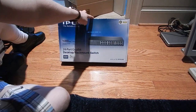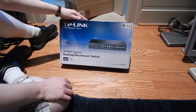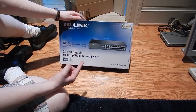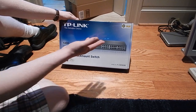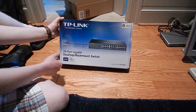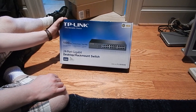A nice 24-port TP-Link switch — this thing is gigabit obviously. The reason I picked this particular switch is because of its size; it's a nice and small switch. I realize you can get old 3Com switches for like 50 bucks on eBay, but I don't want fans in there because I don't like my bedroom sounding like a networking closet. It's an unmanaged switch so it doesn't really need a fan anyway. I don't need VLANs or anything like that, so this is really all I need.